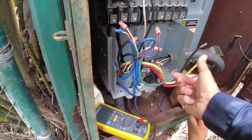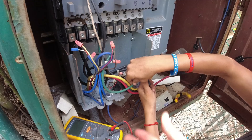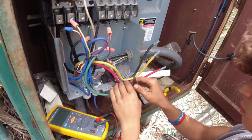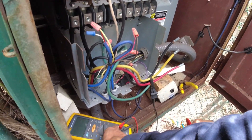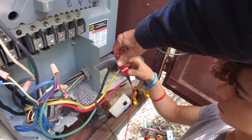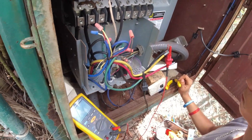Clip your common probe onto that copper right there. Once you clip it on, give it a nice pinch and put it down in the teeth — down in the back of the mouth — and give it a nice pinch. That's a good connection. Now for the insulation tester, start with Line 1 — do the same thing, pinch it and make sure it's a good connection.